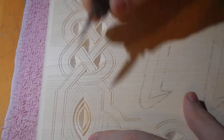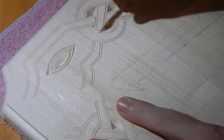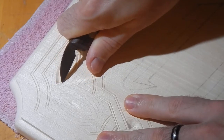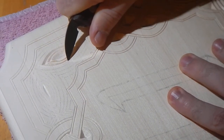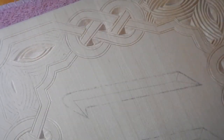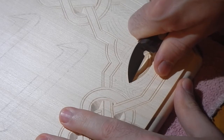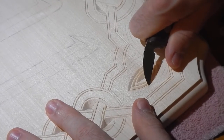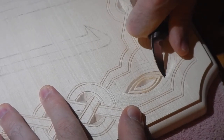With these two chips, two sides of the chip that come to this point, I always want to make sure I don't cut too much off. I don't want to lose that point right down there in the deepest part. So I find I usually end up making those first cuts right there a little bit shallower than what I actually end up needing, and having to come back, as you've seen a couple times here. Which, again, is not a big deal to make that last adjustment. I'd rather go back in a second time and make that kind of clean-up cut rather than lose some of the chip and weaken the design there.